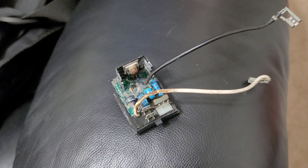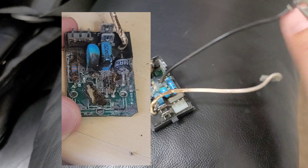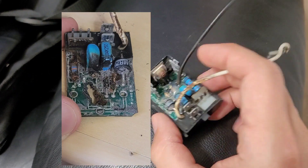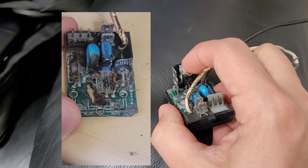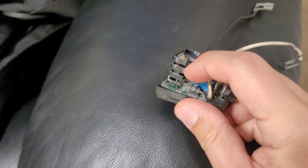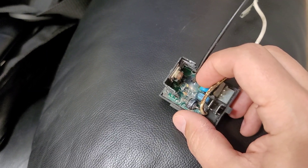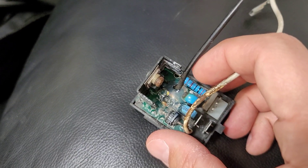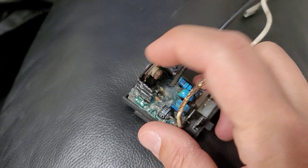Here's a picture of the interim progress. I have not seen this much damage to a board like this before. Typically the main failure points for this regulator are the silicon controlled rectifier on the heat sink, or this very large diode that will fail. These smaller parts are not under as much stress but they could also burn, though typically those are the two main failure points.